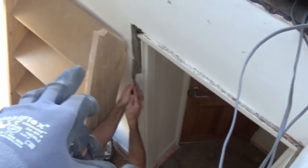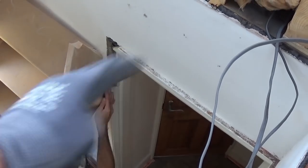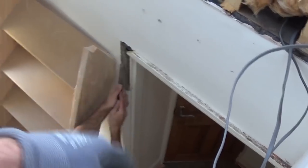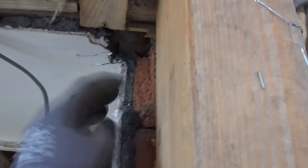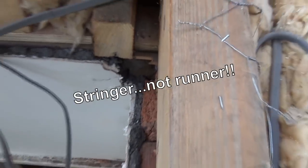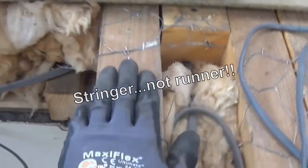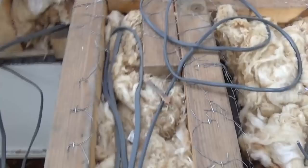We've done a bit of trial and error with the stairs. We've got a big post in here now; he's just chopping out a bit of the architrave. We've marked that out and we've got a bit of the stairs going across that door frame diagonally. Up here we had a few attempts — we had to take a chunk of the brickwork out just there to allow the bottom of the runner to fit in, and now it sits nicely on this joist. On the other side we had to trim a little bit of mortar as well.